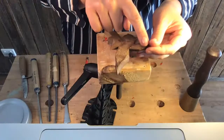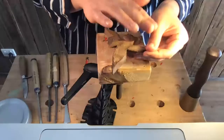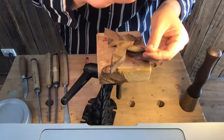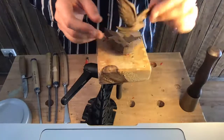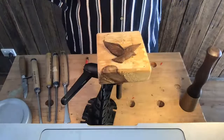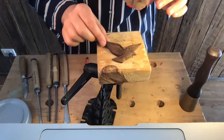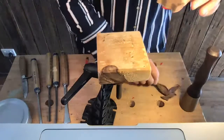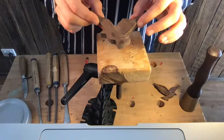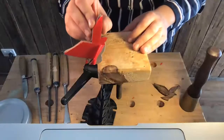I always use computer paper — don't use newspaper. Just with PVA: one coat there, one sheet of paper, another coat of glue, another sheet of paper, glue on the back. So you've got two layers of paper. Glue it onto your work surface and clamp overnight. After you finish carving, you can separate that with a knife — that's the paper chuck method. But because I often like to get stuck straight in, I'm too impatient to wait overnight, so I go the double-sided tape method.